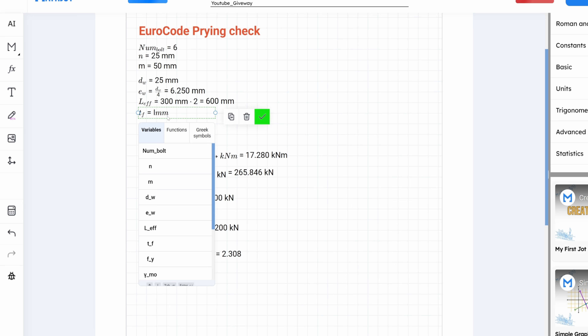When you're looking at the FEA, potentially it's stiffer than you're actually expecting — it's not yielding as expected, which means those forces are potentially a lot lighter. However, you can double-confirm this with simple hand calculations when looking through the base plate and stiffness requirements.